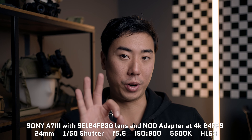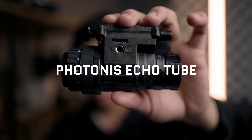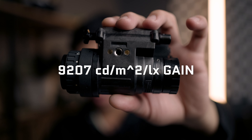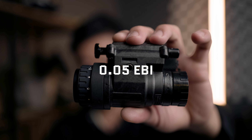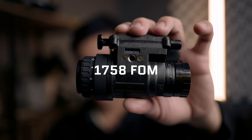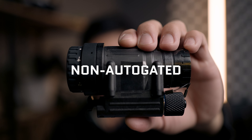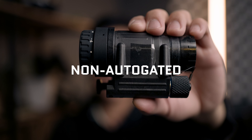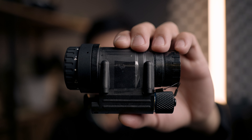In this battle royale of PVS-14s, we have three intensifiers. Our control is a Photonis Echo tube in a Carson housing with specs of 9,207 gain, 26.24 SNR, resolution of 67, and an EBI of 0.05 — converted to US units that's 0.5 — giving a FOM of 1,758. The second tube is the NNVT-5, which we've carried in the past but are likely phasing out. It is not auto-gated, though it still protects against bright light damage, but at greater cost to image clarity versus auto-gating.